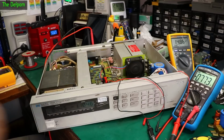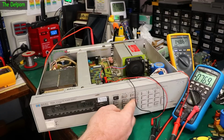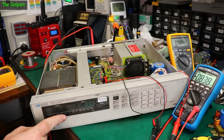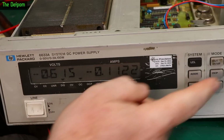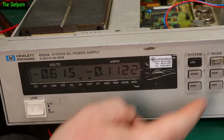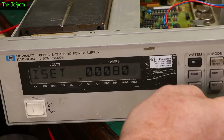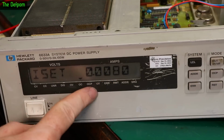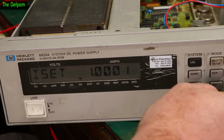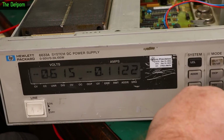But we see negative values. Now, I don't have the sense terminals hooked up. That could be something to do with it. So this is interesting. Current set 2. Is that actually consuming 2 amps of current? Disabled. It's also got overcurrent showing up. So this is on overcurrent, constantly on. So I think current set is 0.008. I thought I set that 1. Current set is now 1. Voltage set is 0. Did not remember it over power cycles.